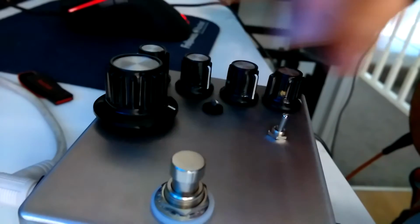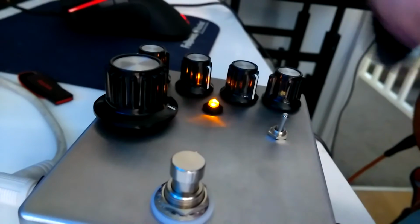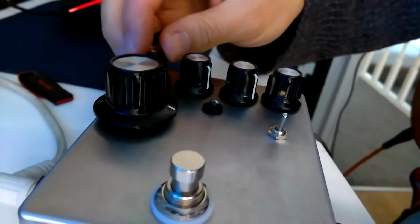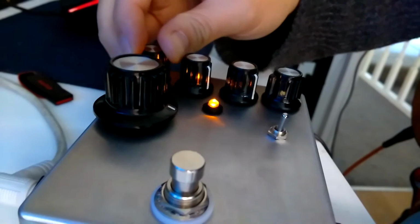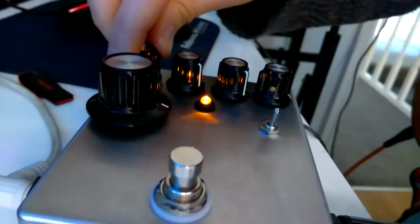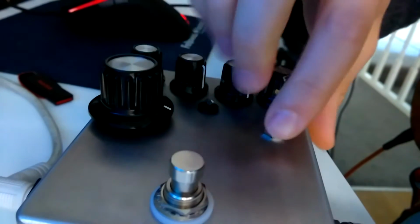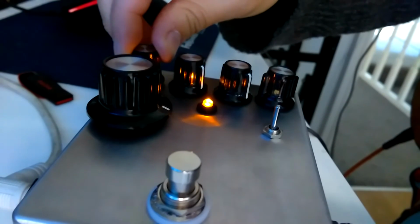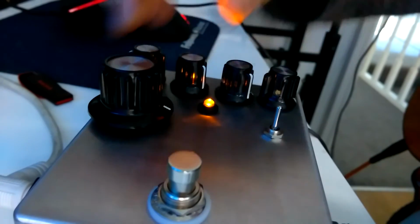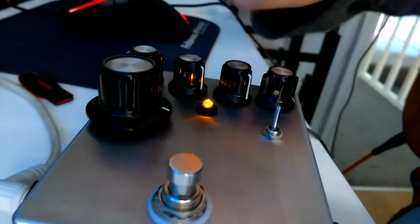It's kind of a tremolo, but also a filter. So you've got this timer, this envelope, which is adjustable in speed, just like a tremolo is. I've actually put a logarithmic pot there when it should be a linear one, so it's a bit fussy when it comes to the speed. Micro movements really. So you've got speed, you've got depth, like you do on a tremolo again.